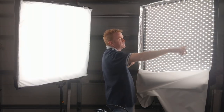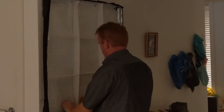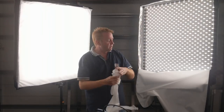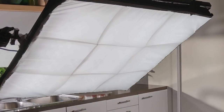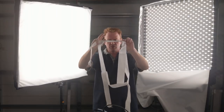You might notice I don't have the spacers in here. When you buy these they come with spacers — there's fabric mounted between the panels so the front panel can't press up against the LED emitters, maintaining a bit of space. The problem I found with the spacers is they were causing a pattern in the front diffuser that was reflecting on surfaces, which was just as irritating as having the dots. The other issue was the spacers literally get in the way of the light emitters — as soon as I removed them I got another 12.5% brightness.